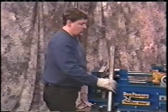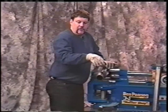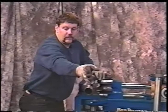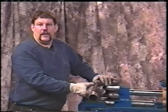The one point that I want to make here is to show you that offset we talked about. By laying that flat on top of here, you're able to see that that pipe doesn't kick straight up. It actually kicks up and over to the outside of the vehicle like we needed. Then this brings it back level, allowing just a couple degrees of chase for the muffler to move over away from the rear axle housing and the knuckle. So you can see by this that it comes over here, kicks up and over at the same time and levels out, and you see how you can do that in one bend. Now we'll go over and install this on the vehicle, slide it into the muffler, and we're ready to weld this front section.